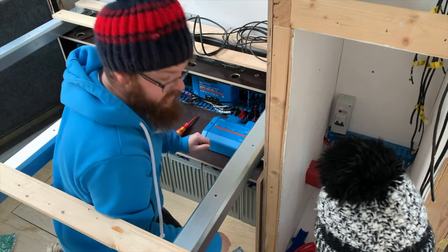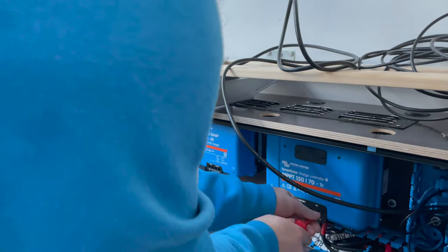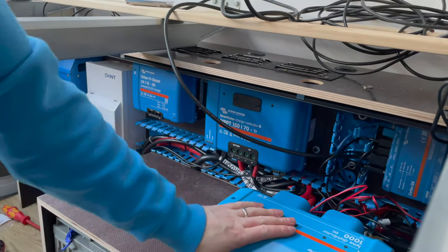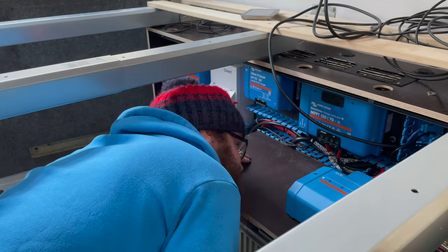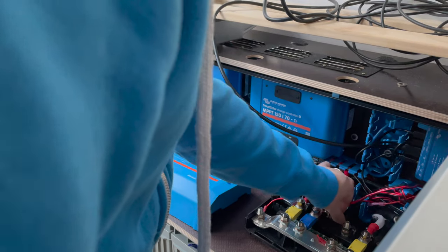From the solar disconnect we're going to pass the cables through the cupboard. We've put the positive and negative PV cables in. The ferrule has helped a lot — it's given it a nice biting point. We'll just put a couple of P clips in there to secure those wires; all of this does need tidying up. That is secure. Now I'm just going to check that everything is in the right place. We've got positive, negative, likewise positive, and then coming up the links we've got the positive going on to the positive bus bar through the fuse, negative, and the ground on the ground point.